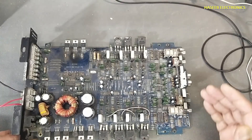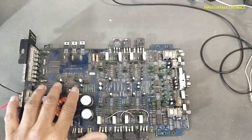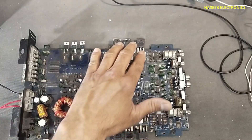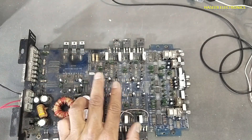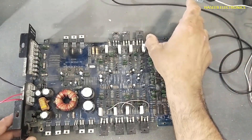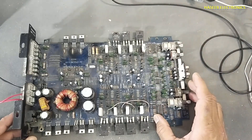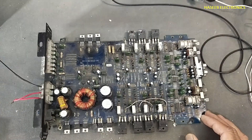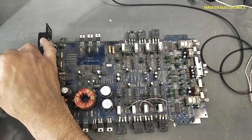Friends, welcome back to my channel. In our last session we repaired this TL494-based power supply for this car audio power amplifier. The power stage is configured as an NPN and PNP transistor push-pull amplifier to drive the speakers. Today we will see how this pre-amplifier and bass mixer stage works. We will apply power to 12 volt, remote on, and ground — this is the return side.